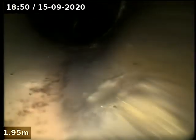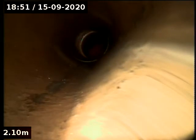Connection looks pretty good — looks really good actually. There's the joint. It's got a Plum Quick, which is a rubber boot. Sort of set up — there's a little bit of a gap there, hose clamps sealed. It's out in the lane. We've come back a good couple of feet. The connection — we go back out — all 100mm earthenware.